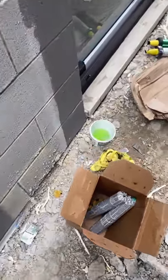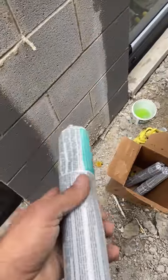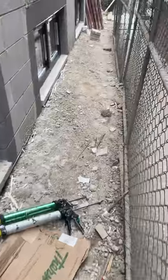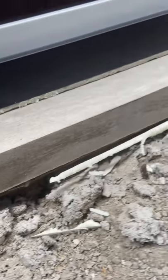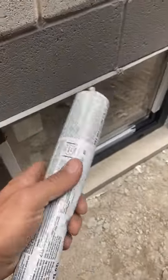If you're in the building or window business, you've likely worked with sausage caulking — 100% silicone, really good stuff for commercial window applications. For big gaps, which can be up to one inch or even bigger, you need this because the window and building are moving, and you have to make sure the silicone will not crack.